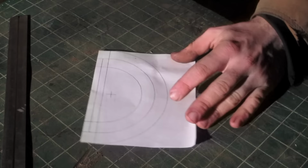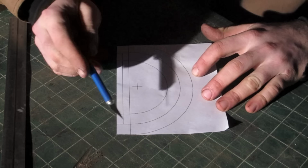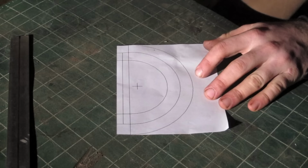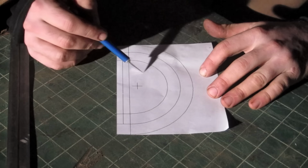Moving here though, I do it now in separate plates. This whole shape will be a quarter inch base plate, and then this shape here, and then this shape going around will be other quarter inch plates. This one will be welded around from the outside, and this one will be plug welds on the surface.